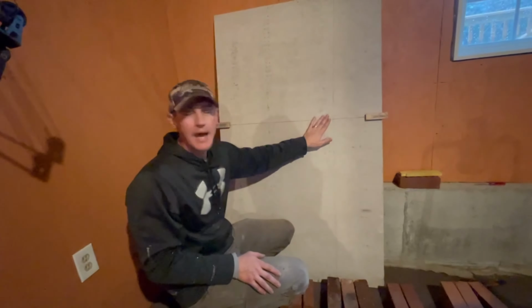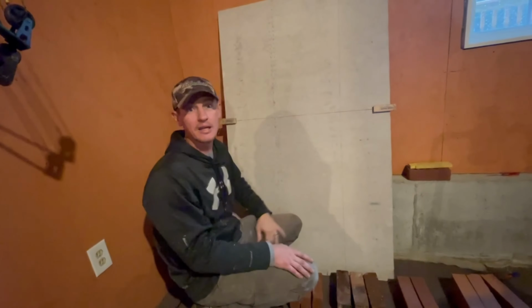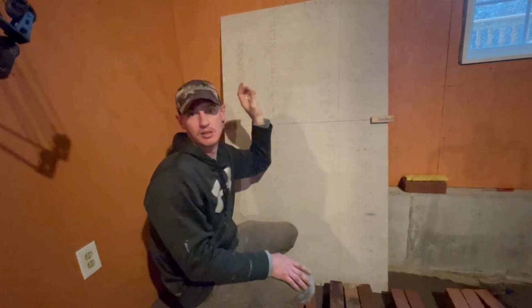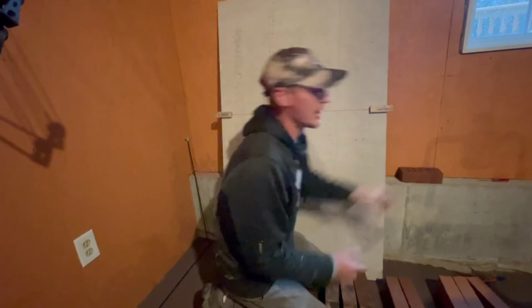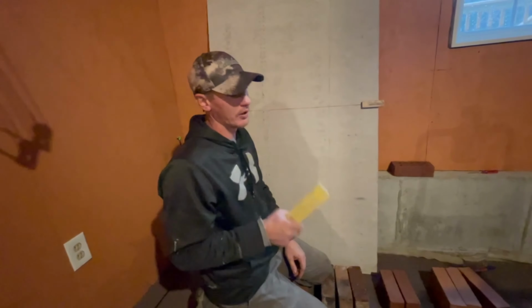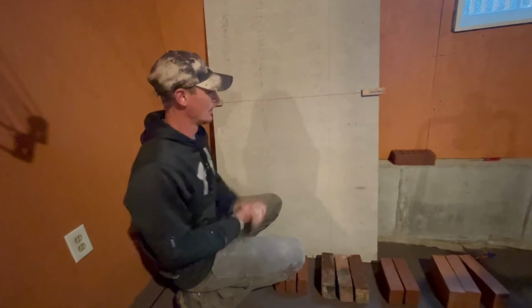But the problem with that is all of a sudden you get close to certain heights and you have to squeeze a lot, or you have to gain a lot to get your height. So you just have to gain every course. And then you get big fat stripes in your brickwork, which you're trying to avoid. So that's why you want to use a standard brick ruler. It's why I use a standard brick ruler, because the heights work out much better for this type of brick. And you can bump and grind a little bit here and there if you need to. That's fine.